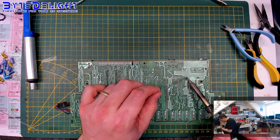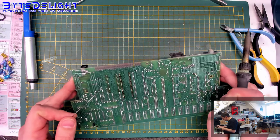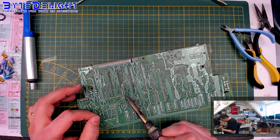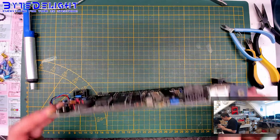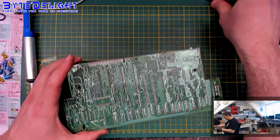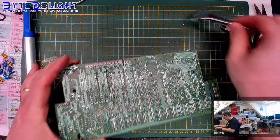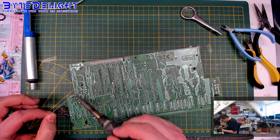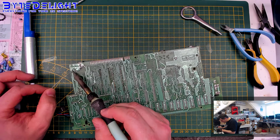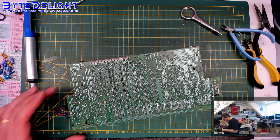That's not needed to clean it, but I think it's good to make the board look as new as possible, especially after a refurbishment job. I think it's part of the quality, if you ask me. And I sometimes think I would like to have an ultrasonic cleaner, but that could mean that you will rub off more of the solder mask, and I don't want to do that. So we'll probably just keep using a bit of alcohol from time to time. And I mean on the board.